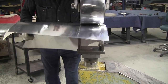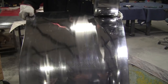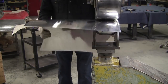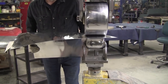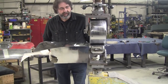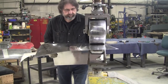Now remember, if you make any mistake, and you're going to make mistakes, that's the name of learning any craft, is moderating the mistakes, not eliminating them. It's impossible to eliminate them. The beauty of this craft is it allows you to make a lot of mistakes and still recover. You've got to be really egregiously bad in your habits to make a mistake that's so bad, which would be hammering the valley, the reverse curve valley. So here I am, I'm releasing that edge a little bit, and that should be enough.